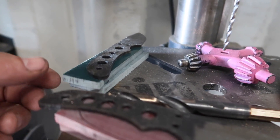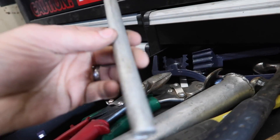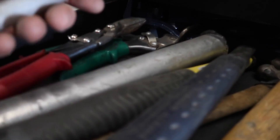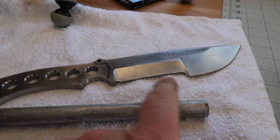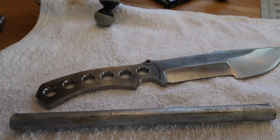I've got a couple of things I need to get done, but I think what we're going to do is quickly machine these little inserts for this knife. I need to find a piece of aluminum. I've got this piece I sometimes use as a drift, but I've also got a bunch of brass. I'm going to take this piece of aluminum — it's big enough, we won't be wasting too much material — chuck it up and turn it down to just the right size so they fit inside these holes. We'll need three pieces, so let's do that.